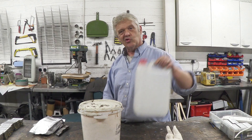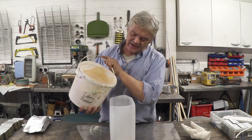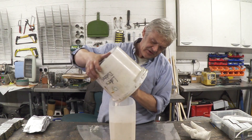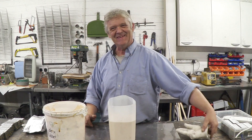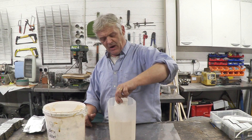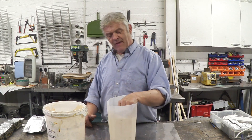What I've got here is some latex rubber and a container big enough to take my hand. I'm going to chop this top off and fill it with latex. Both the latex and the alginate are freely available on Amazon. If you have a latex allergy, well, you shouldn't be doing this. Then all you do is take your plaster of Paris model that you've just made and dip it in there, then give it a little bit of time.